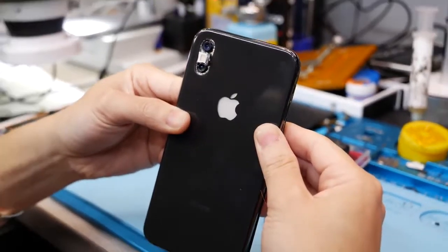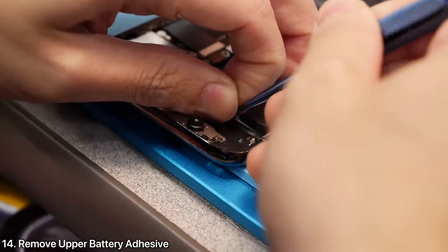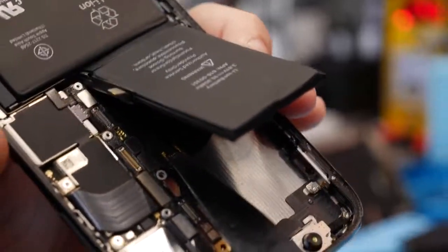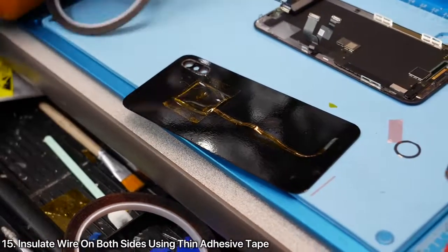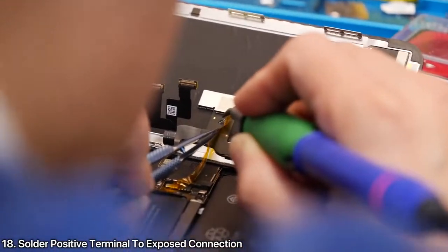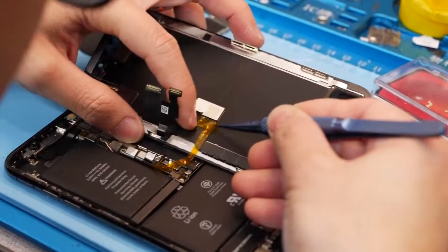It's very important to secure the Apple logo to the back of the shell using a very thin adhesive tape made specifically for working inside phones — make sure it doesn't rattle or move around. Trung was very thorough with taping down all of the connections, making sure everything was insulated against shorts. To run the wire through to the necessary connection pin, we remove the upper part of the battery and fold it up. If you removed the rear glass beforehand, you can feed the wire straight through into the shell without cutting through the wireless charging pad — that's the method I recommend. Once you pull those through, solder the connection pin to the exposed positive terminal we revealed in the display, then tightly insulate it and make sure there's no extra slack. Trung was very thorough here — this is how I know he does a very good job.